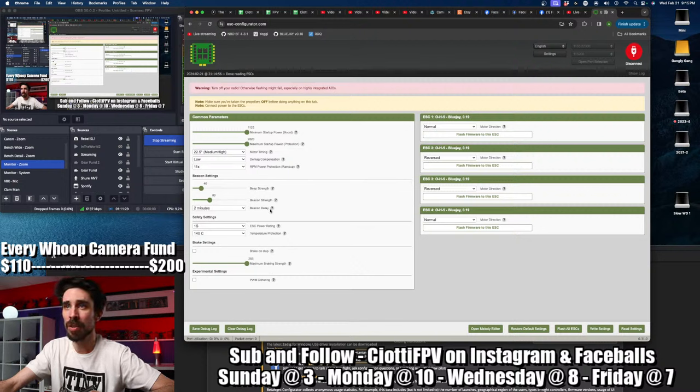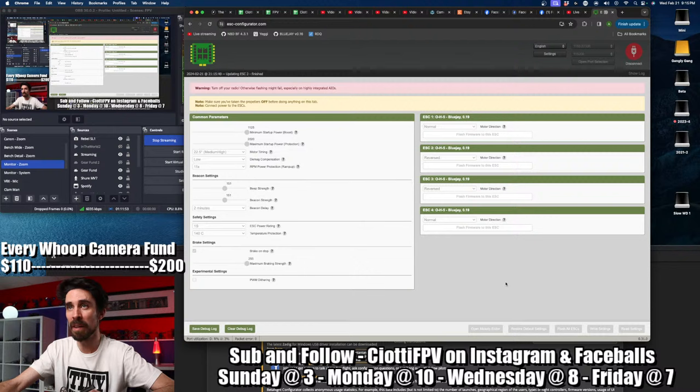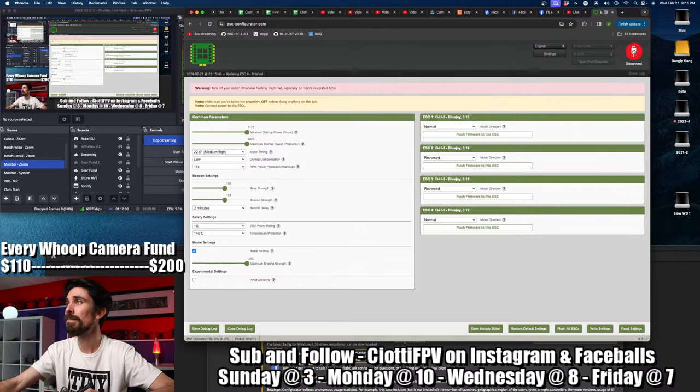I do like to change this beacon delay to 2 minutes. This way, if it's plugged in for 2 minutes and you haven't armed it, it'll start beeping as a nice little reminder, like, hey, idiot, you plugged me in 2 minutes ago. And I also like to turn these beep strengths up because on Tiny Whoops, the motor beeper is really quiet. So again, absolutely no reason to change any of this stuff. It's just simple little quality of life things. Wow, the startup powers are maxed out. That's interesting. Okay, now we're good.